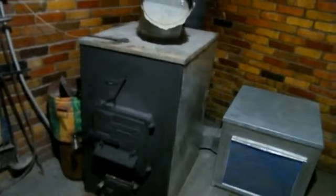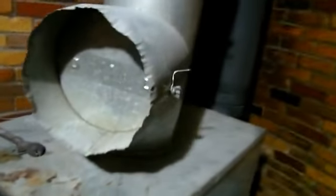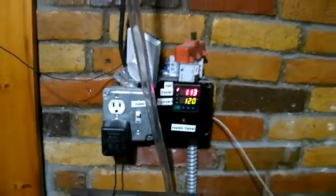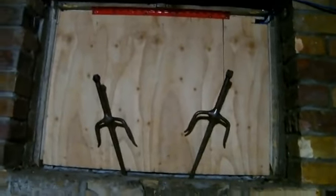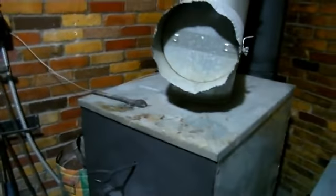Alright, when I say stove, I mean our Jensen forced air wood stove that's ducted into the household ductwork. Forced air, usually get an air temperature somewhere between 120 and 200 degrees. And I figured, well, a guy could probably duct that and make a fixture on the window where we bring our wood in. And one side would be outside and one would be on the inside, and that would vary with the air temperature coming out of the stove and the air temperature outside.